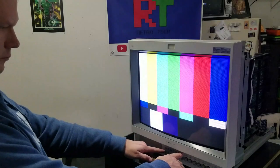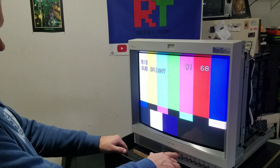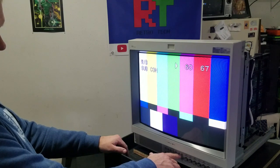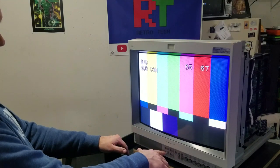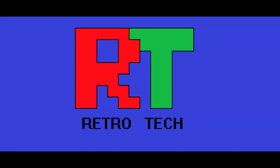There's also a setting in the sub menu to control sub brightness and sub contrast, which need to be tuned down to a reasonable range so that you're not putting out too much contrast or too much brightness on your screen. Going into the sub menu and changing sub contrast and sub brightness to a reasonable level — and always remember to hit degauss twice to write any changes to your monitor. You're never going to get rid of all the noise that comes out of a CRT; it's just part of the technology that makes this display work, but you don't want any extra noise that can give you a migraine headache or make the CRT experience unenjoyable.